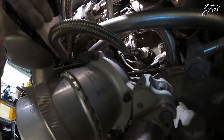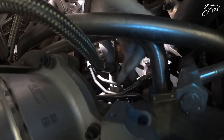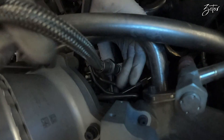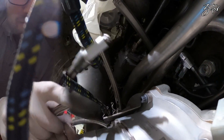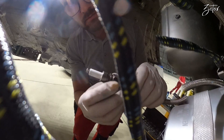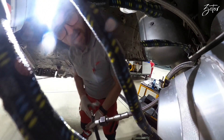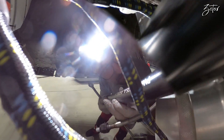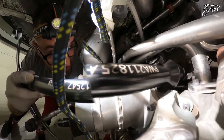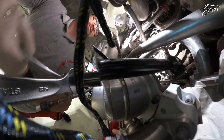We'll do the same procedure: first of all loosen the nut of the igniter cable, and when that one is loose, remove the cable. It doesn't look like it on the video, but I really don't have that much room for my hands, so it's sometimes a bit of a struggle on this engine. Cable is out and it looks good, so I can proceed with removal of the igniter plug. The body of the igniter adapter needs to properly sit on the diffuser case insert, and only when I'm sure of that can I remove the igniter plug.